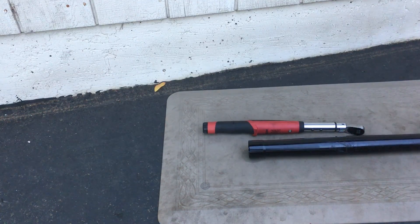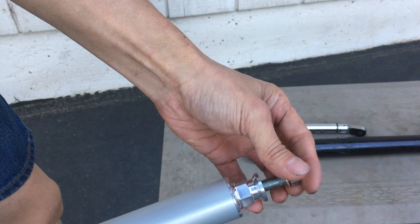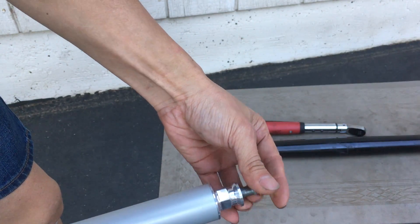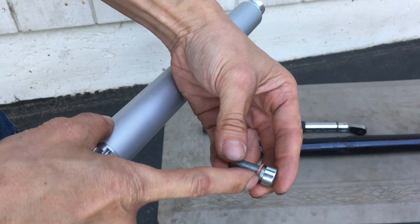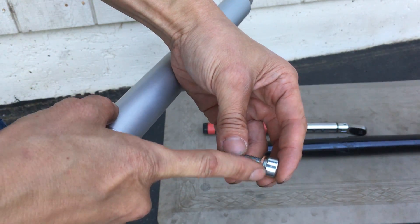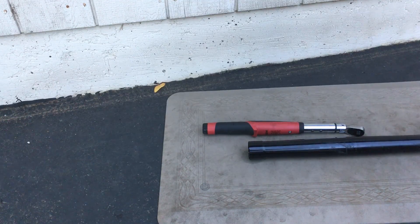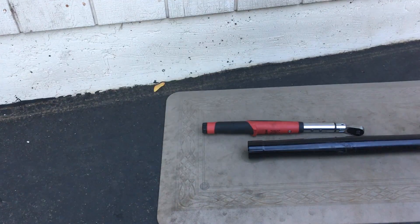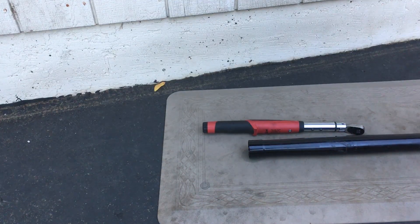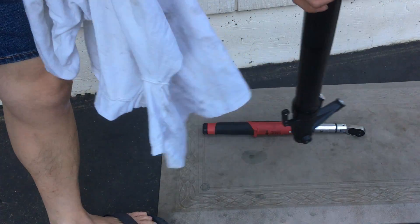You should double-check that the screw at the bottom of the leg has the same thread — and yes, same thread. I'm also going to have to clean up this thread because it has the old Loctite on it. I need to pull out this sealing crush washer because I have a new one, clean off that Loctite. I have a new seating washer here from Yamaha.